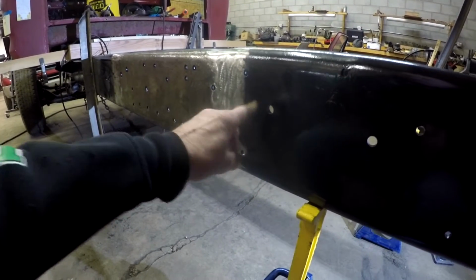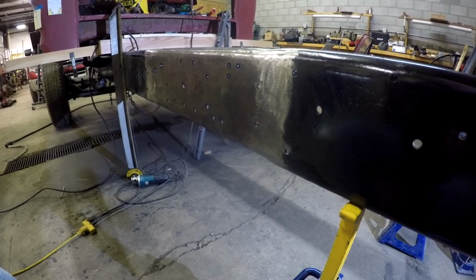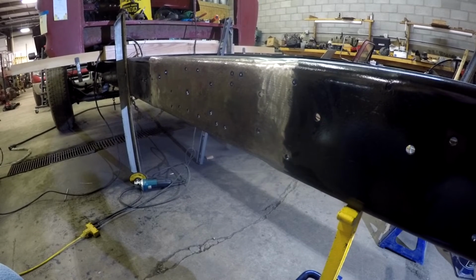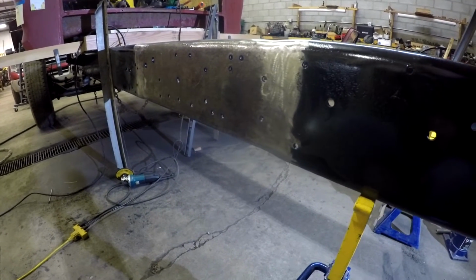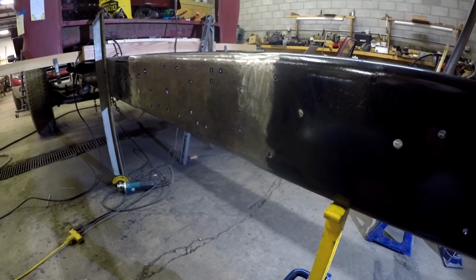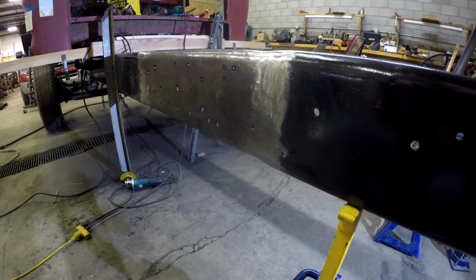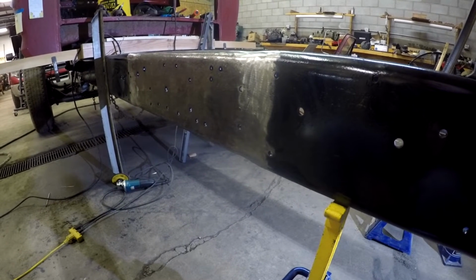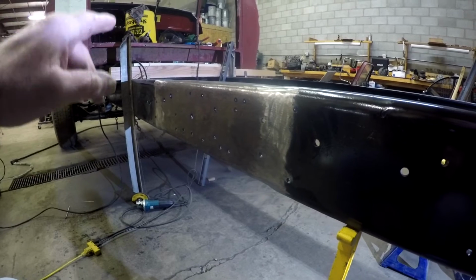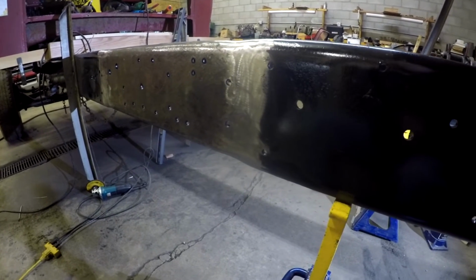When I got the inner rails for this, that is a truck, an authorized truck remanufacturer, in other words, they modify trucks to accept different things. They lengthen frames, they shorten frames. I asked him about it, and the guy that I talked to didn't know the answer to my question about whether you could or could not weld a truck frame. But he says that when they do it, they are authorized by the truck manufacturer, and they have a listing or a label that they stick into the truck door frame, certifying that it was done by them and it's authorized.